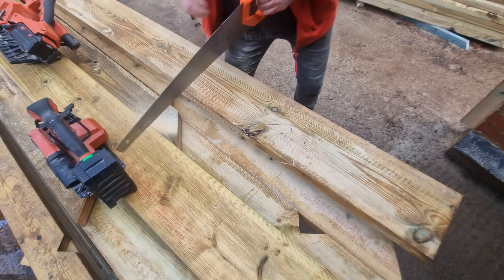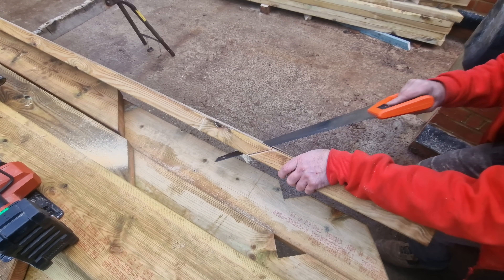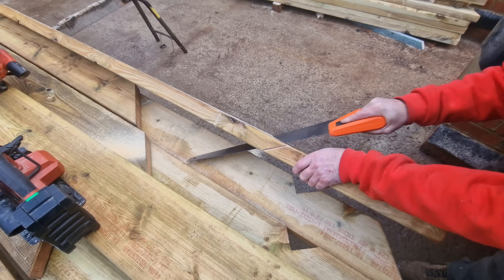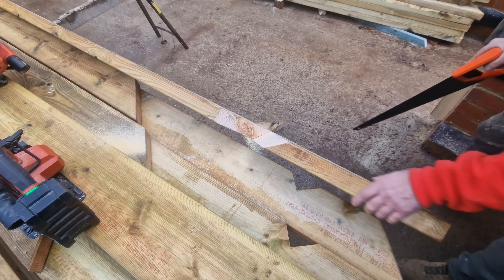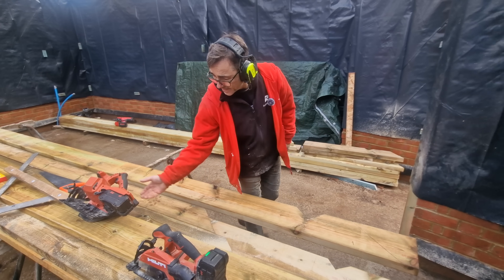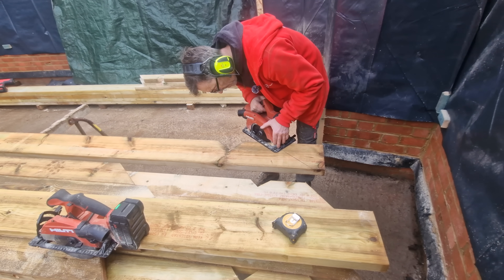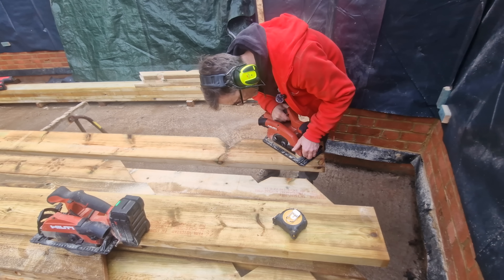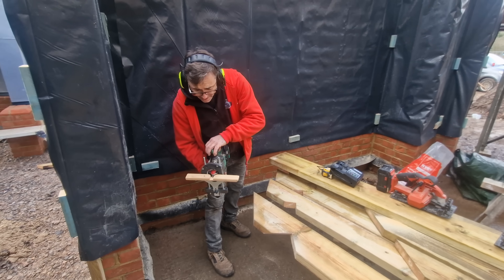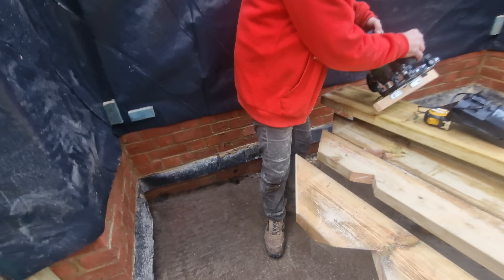Just finishing these cuts off — I can use the saw for most of that and then the last bit with the hand saw. So that's our bird's mouth. Just quickly cut the foot cut off there, and then route it. One of the features of an open eave is we like to just soften the edges, so I'm just going to run an angle off here — just gives it a nice detail.